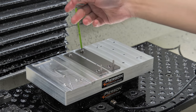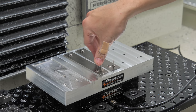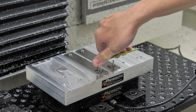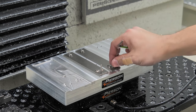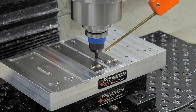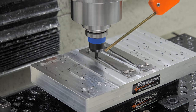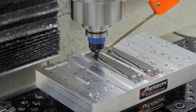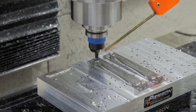I don't really like the shoulder screws either though. For some reason the precision shoulder screw has an Allen key size of 3/32. So just like my old small clamps, I have to be careful not to ruin the screw head. I got braver here and I cut out the shape of the blade with 2 slotting passes. I didn't have a lot of room for an adaptive toolpath, and I didn't want to spend the time either. This seemed too hot to do without flood coolant.